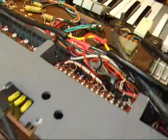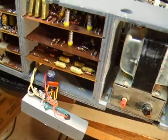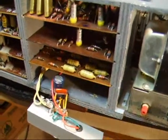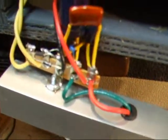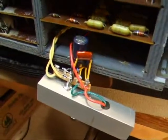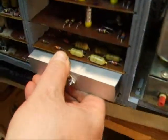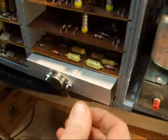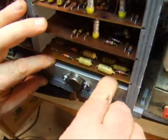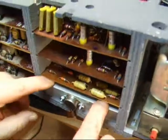We've got this whole regulator set up so that it feeds the expression lamps and also the pilot light, and it's isolated from the other ground — the preamp ground — so it's on its own. We don't really want to tie the two together for fear of having any sort of ground current go through the preamp's ground. The unit slips in. That's the filter — I'm touching the filter board — and it's bolted in from underneath.